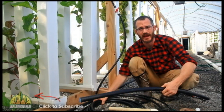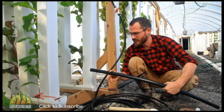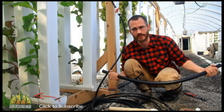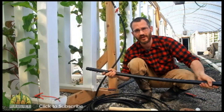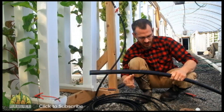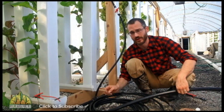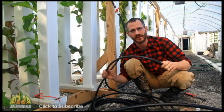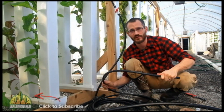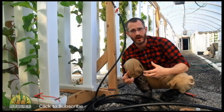There are two major types of pipe I use and recommend. The first is poly tubing — a polyethylene plastic that's somewhat flexible, so it lets you send it around corners and avoid spending money on L fittings. We mostly use one-inch for our mains, running off a large pump, and half-inch for all the feeder lines. It's flexible and can do all sorts of things, which increases the efficiency of your pump and water pressure.